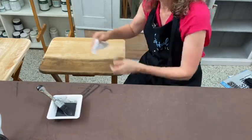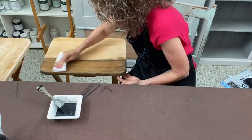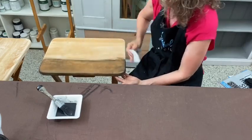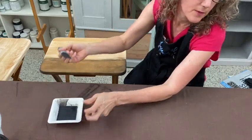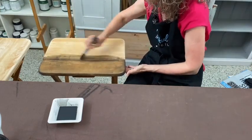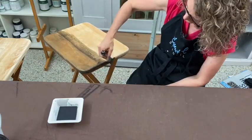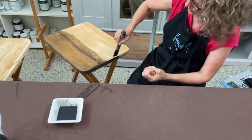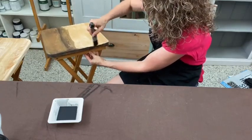You can see the difference when I wipe it back — it wipes back some of the stain and you want to wipe off the excess. I can see a little bit of blotchiness from my sanding. Sometimes you have to completely sand things back again, but when you make mistakes it's just paint and can be sanded off. When you get to the ends of the table, that's what we call the end grain and it can soak in the stain a lot darker — you can see it's much darker on the end than on the top.